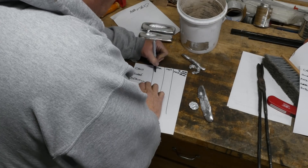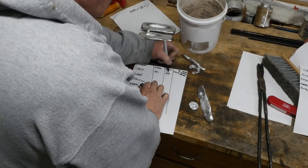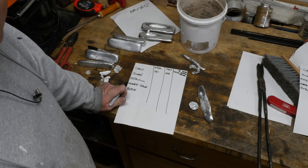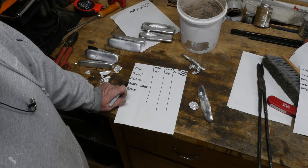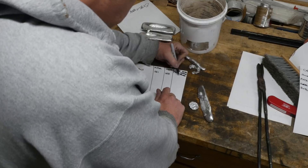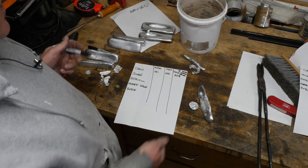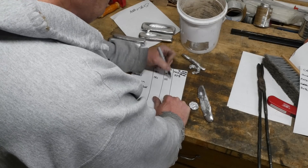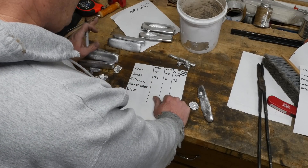When we did the cans, I started off with 561 grams of raw material. What we ended up with was an ingot of 188 grams. I weighed the dross and ended up with 312 grams of dross, which means I lost 61 grams of something somewhere — it could be the paint on the can, or maybe sugars in the bottom that boiled off. That yielded 33%. The next one was the swarf — started again with 561, ended up with 52 grams, and that's 9%. Swarf was horrible. There may be a way to improve that, but horrible stuff.